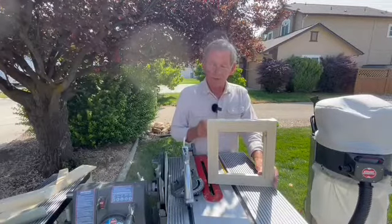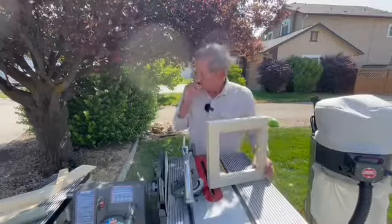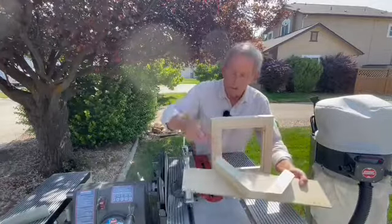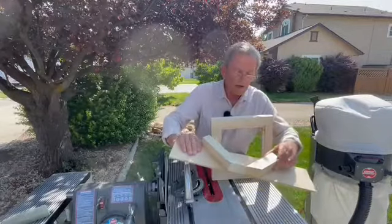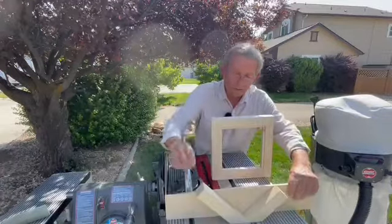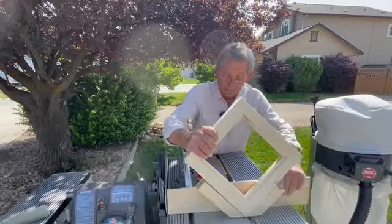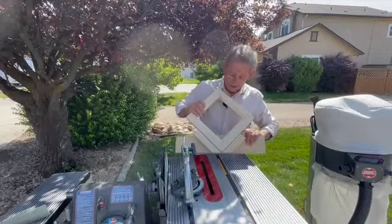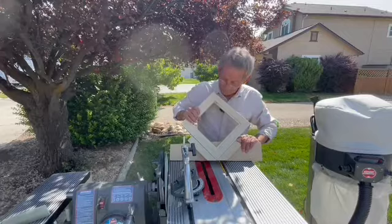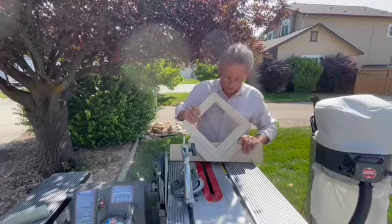But if you want to make these things a little bit stronger and at the same time even classier, let me show you something. This is a quick little jig that I made. These pieces here are actually scraps from the material I used here — they're already cut at 45 degrees, just glued onto a scrap board. This is going to become a splining jig. It's good for frames and boxes, whatever it might be. If you're going to do a lot of frames, you might want to make a more proper jig — there's some good stuff on YouTube that shows you how to do that.